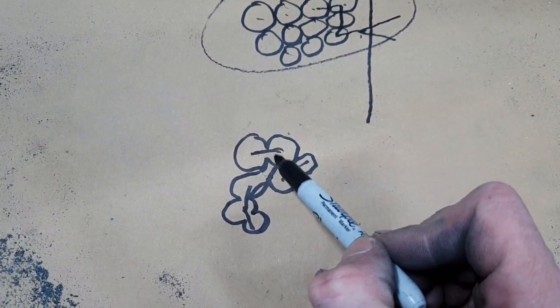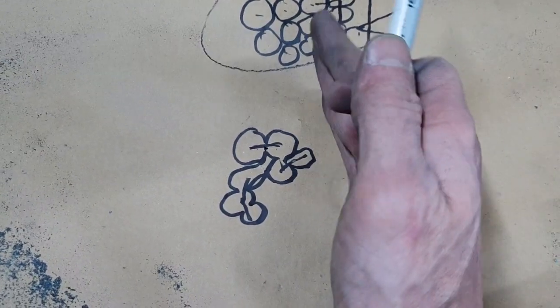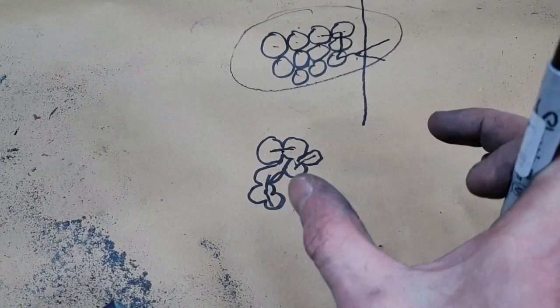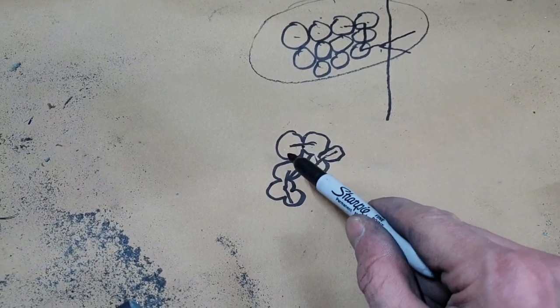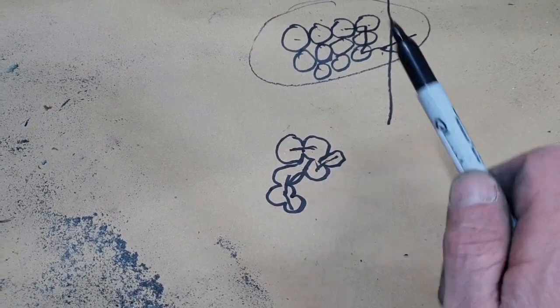Now the smaller these are, the more impact it can take, because it takes longer for the air to compress to travel through each cell, so the foam is slower to react, if you like. So the bigger these are, the softer the foam is.